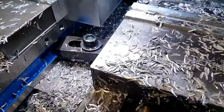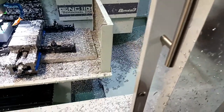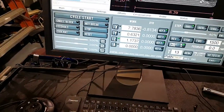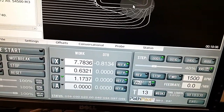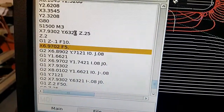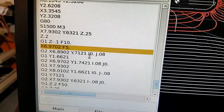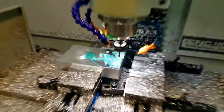I had no idea what it was trying to do right now. If you click on the line on the screen it's gonna bring you to that line in the program. Feed off — yeah, it was trying to do a chamfer around these islands right here, but I forgot to change my feed and speed. My mistake — let me fix that real quick.